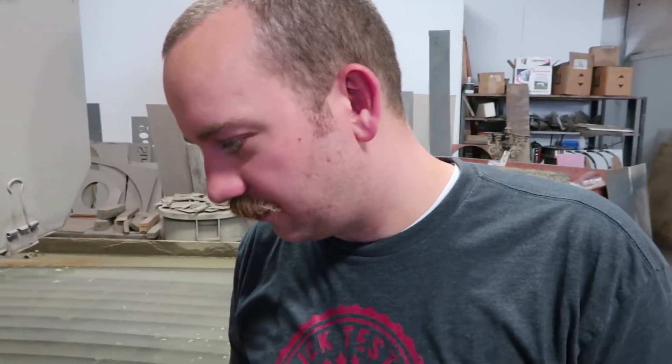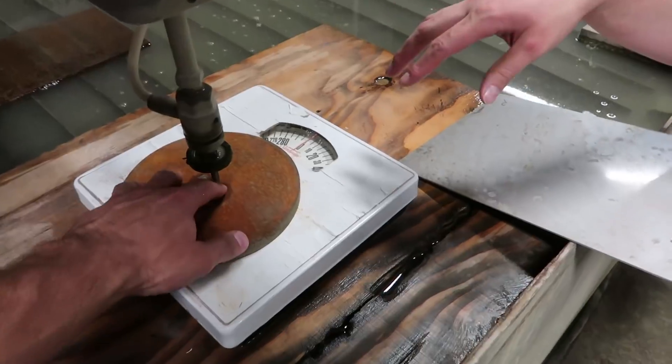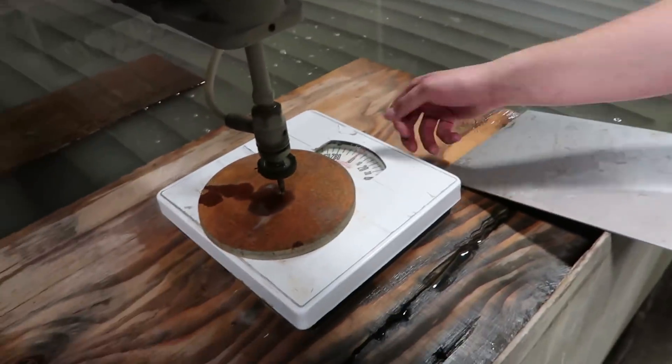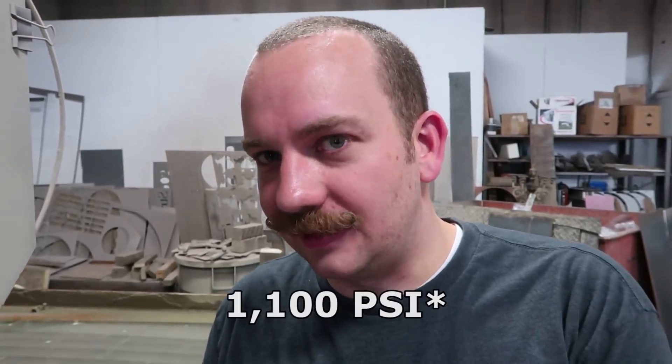We're back and I thought we would have had this figured out by now. Okay, I think we're making it too complicated. 60,000 PSI and we've got 100 square inches, so that's pounds per square inch. When we're shooting it on this, we're spreading that 60,000 PSI over the full area. So 60,000 divided by 100 is 600. I'm not saying it should weigh 600 pounds — the data is telling us 11 pounds. Which means the waterjet is like 11,000 PSI? So either the waterjet is 11,000 PSI or we're bad at math, and I'm thinking more likely we're bad at math.